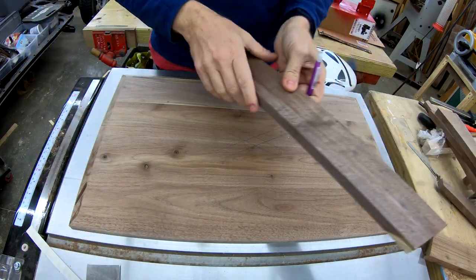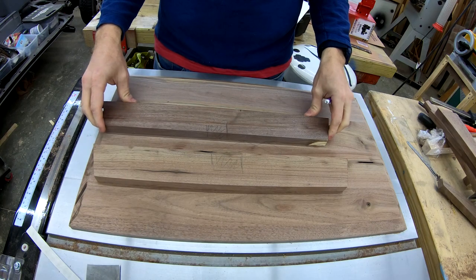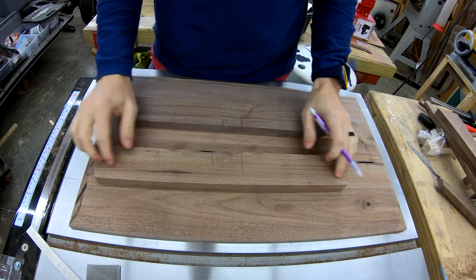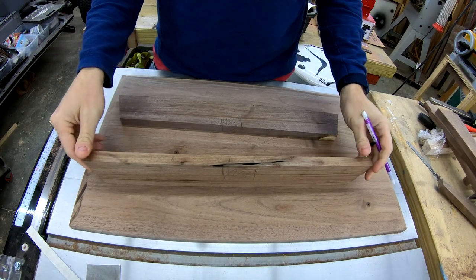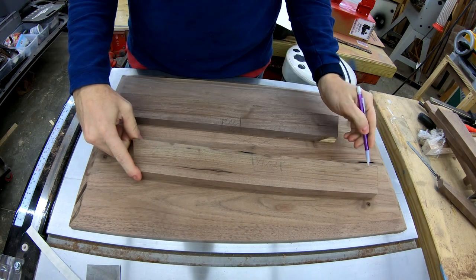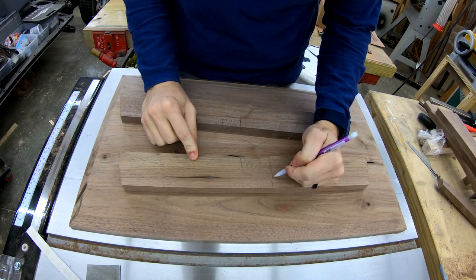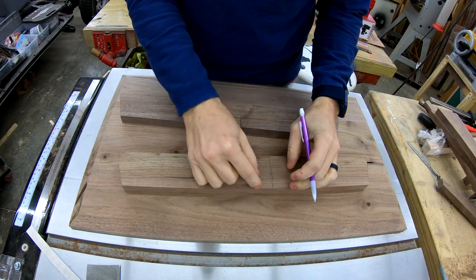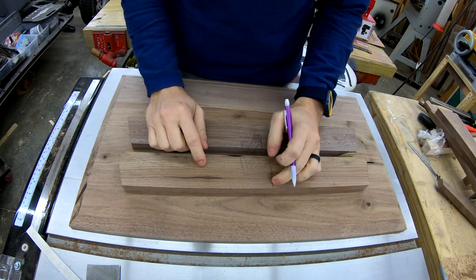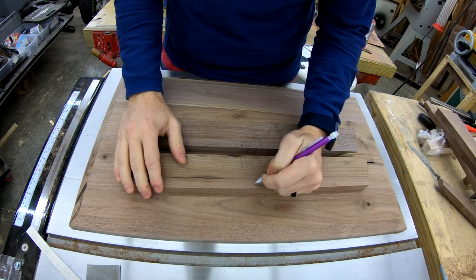So next I need to determine the depth of these notches. So when I cut my curve into these stretchers, like this, the curve is going to go like this. That will leave 1 1/4 inches left at the center line. So what I want to do is cut that in half, so my actual half lap will leave about 5/8 of an inch right here,